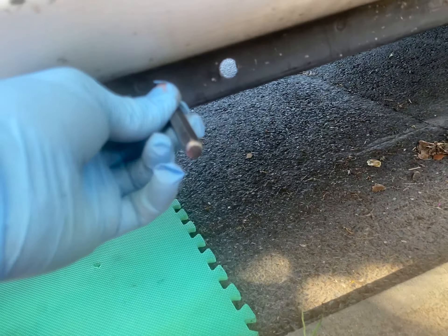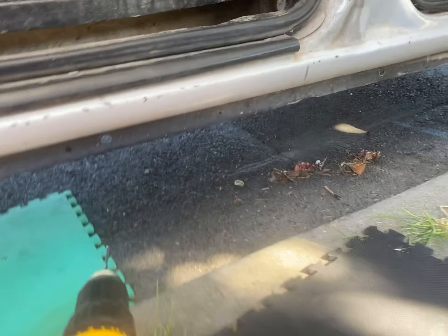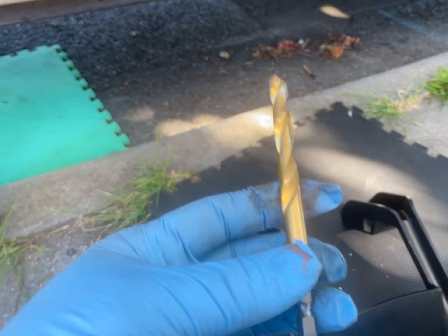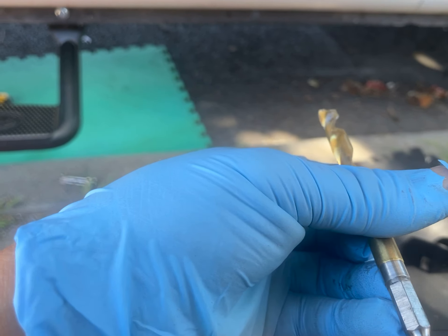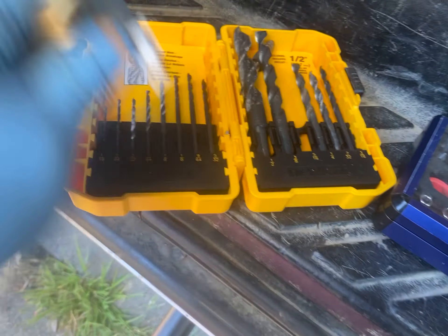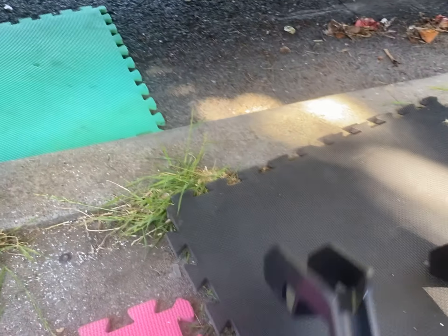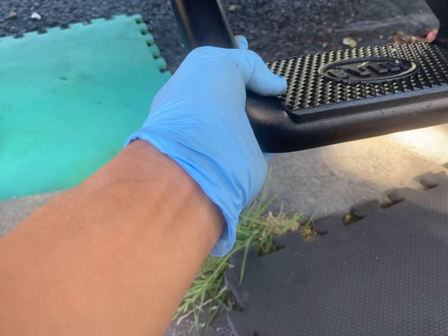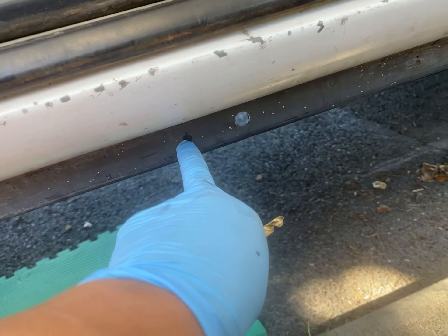There's my mark — I put the center punch slightly above it by a little bit. Same for the second mark — slightly above it by a little bit. So I've got my two marks, then I drill my two pilot holes. After the pilot hole, I come back with the bigger drill bit — a 5/16. So after the pilot hole, drill the 5/16 there. Once you have your hole drilled, you're going to bring this bracket up close to the hole. Drilling the 5/16 means there's a hole in the material.